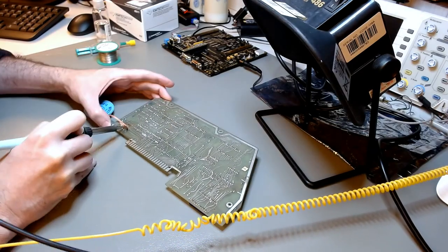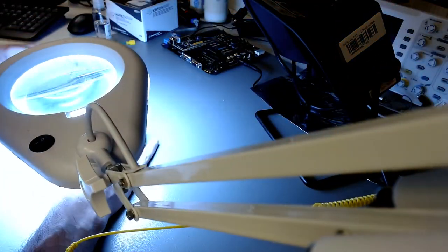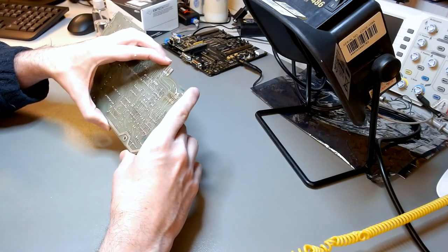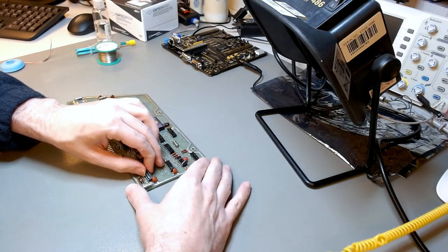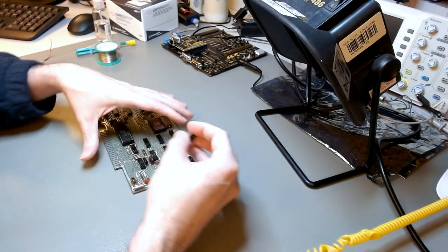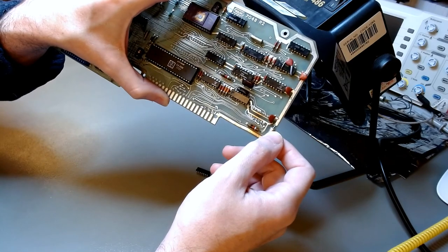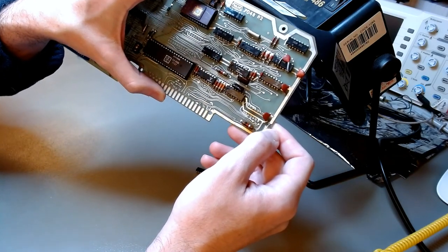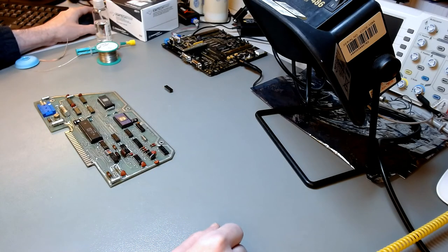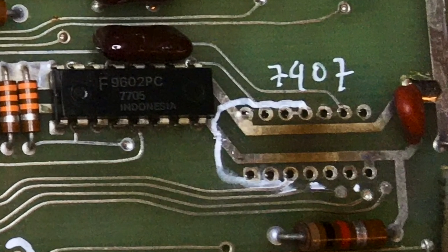This is the 7407 — a non-inverting high-voltage driver — the one that drives the blown light bulb. I noticed some charring on the other side of the board, so I pulled it out. It was stubborn but I removed all the solder. There is charring right underneath it as well. It does operate very hot.